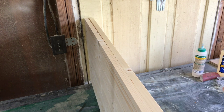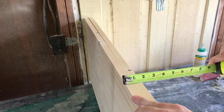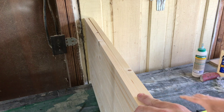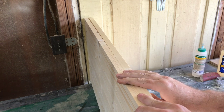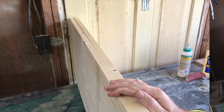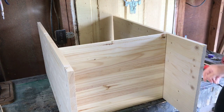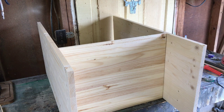To eliminate guesswork, I put both side pieces together and measured them — they're an inch and a half wide together. So when I do my overall measurement I'll take an inch and a half off the 22 inches before I cut. I'm gonna start with the Keurig stand and cut the shelf first. I cut it at 20 and a half inches, so the overall will make it 22 inches wide.